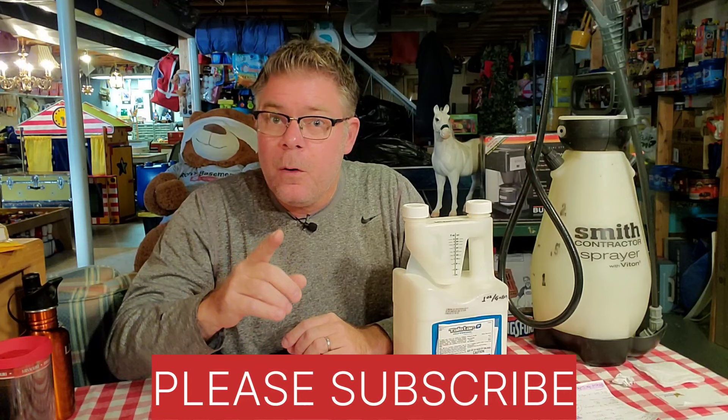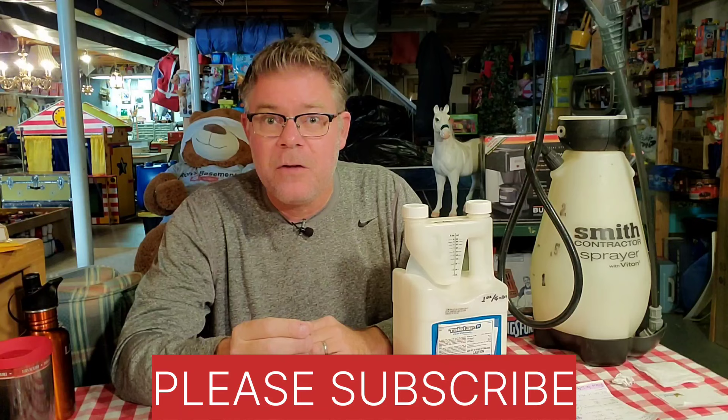You want to read the directions. Make your own decision if you want to take this on by yourself or not, but read the directions. I write on my bottles what I need to mix up. This says one ounce per gallon. So three times a year, I'll put an ounce of this, or maybe two ounces for two gallons, and go around the perimeter of my house where the foundation meets the ground. I'll spray that area about a foot up the foundation and about a foot out into the ground.